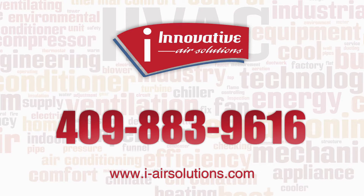Short pieces of flexible duct are not necessarily a problem. The problem again occurs once we get longer than about 14 feet — we start losing significant amounts of air. This must be accounted for in a duct system and static pressure design. Any questions, feel free to give us a call. My name is Robert Curry, our telephone number is 409-883-9616.